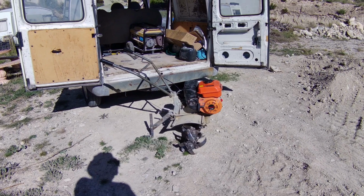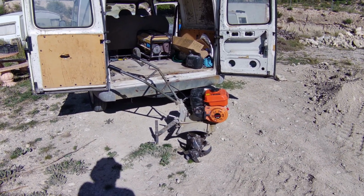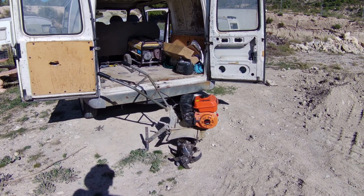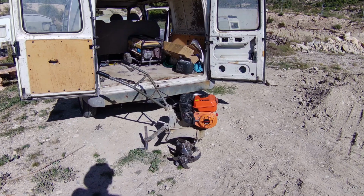We got the rotavator out and found obviously the petrol was no good in it. And we weren't able to empty the tanks. We've had to set the fuel tank off this morning, clean all the fuel tank out, put a new fuel line in to get it started before we even start work.